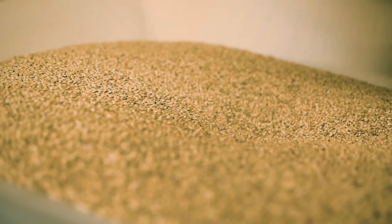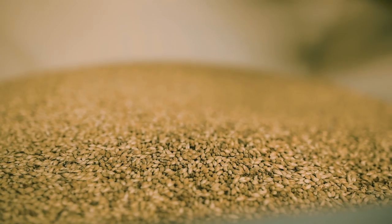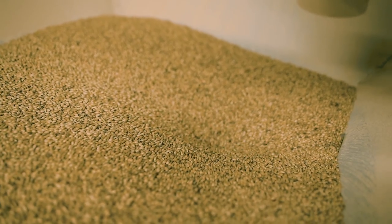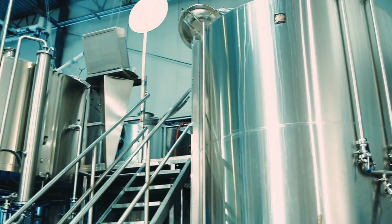After the barley is milled, we'll send it through an auger conveyor system that's going to move it to the batch hopper. The batch hopper is really a silo that sits on top of a scale. We're able to then weigh the exact needed amount to equal what the recipe requires for that particular brew, milling through the mill in the same process until we have the recipe all in one spot. From that point, we're going to move it into the collection of tanks that we call the brew house.